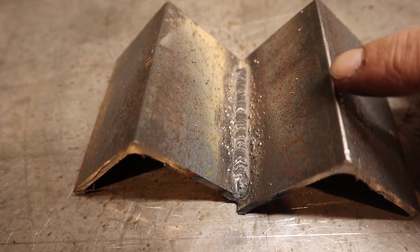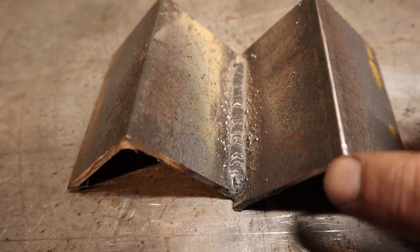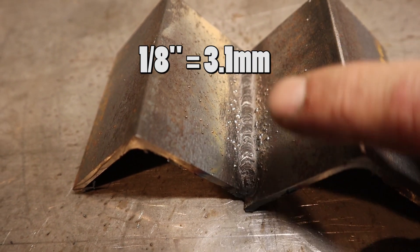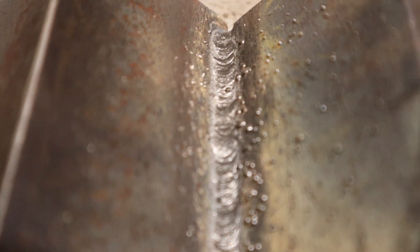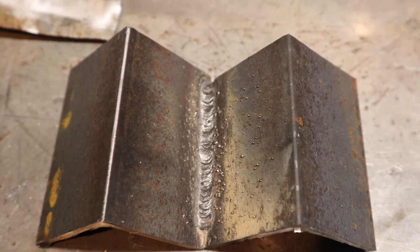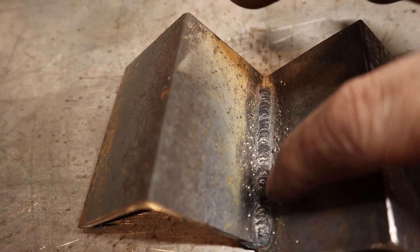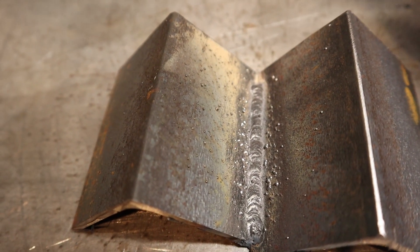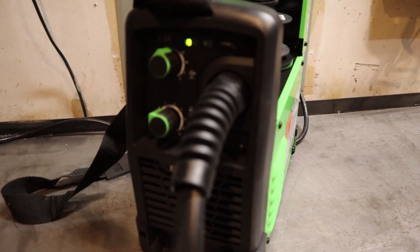This particular application is exactly what this welder is made for — semi-thick material given this welder's capacity. It's eighth-inch angle and we're doing a fillet weld. It laid down pretty evenly and it's plenty strong for whatever you're going to be doing with eighth-inch angle. Overall, this welder is perfect for this application. It's not super clean — I'd expect DC output to be a little bit cleaner — but when you run the wire wheel on it, it cleans up pretty nice.